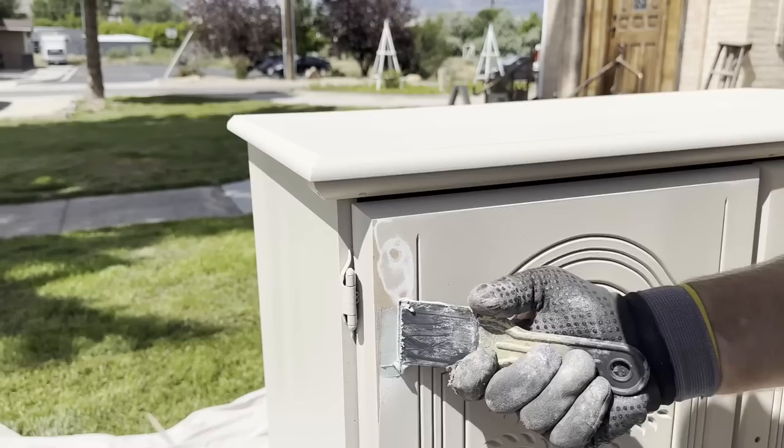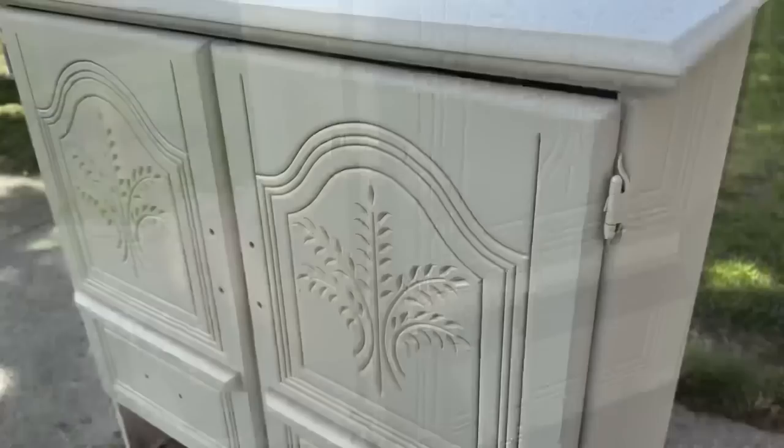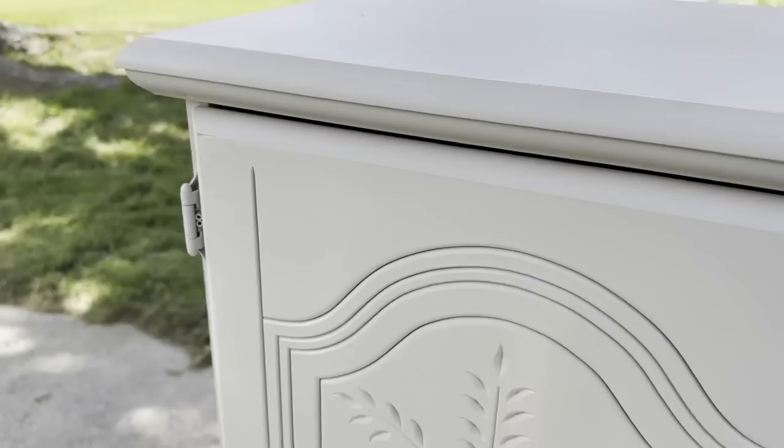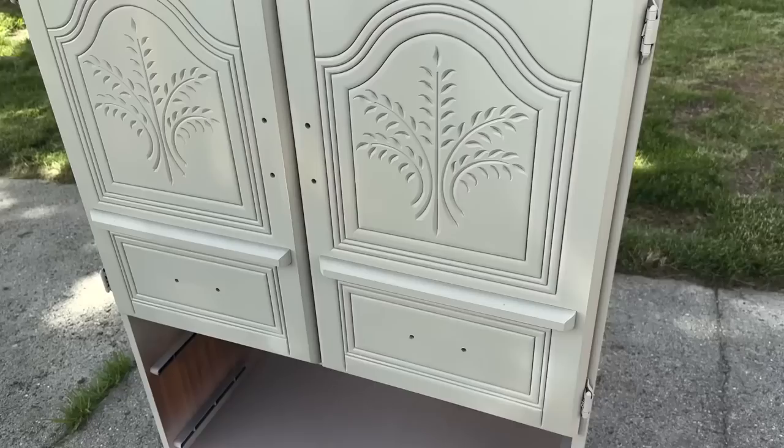So there were a few divots that still showed, so we're just coming back with a second round of bondo. Hopefully you can't see these — if it doesn't work after this, I'm going to call it good. You can see where we bondo'd it that now those circles are gone. Zeb was fussing over it — it's a little bit imperfect here. I'm going to lightly distress it, but if we keep going and messing with it, it's just going to make it bad because this is MDF. So if you're working on a piece similar to this, you don't want to get to that particle board MDF because it's just textured and yucky. Sometimes you have to say, that's good.